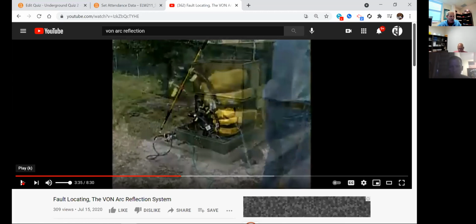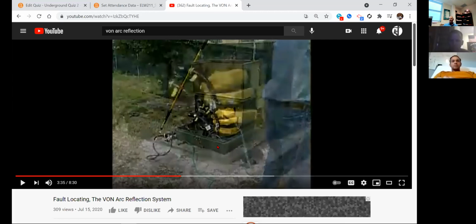What do you have to do with the grounding cable from the piece of equipment before you hook it up? Make sure it's uncoiled fully. Uncoiled, right. I mean, this guy is right beside the piece of equipment. You've got about 20 feet of that cable coiled up on the machine. This is the grounding cable. You've got to uncoil it and lay it out in a straight line as best as possible before you hook it up. Now, here comes the supreme question. Why?